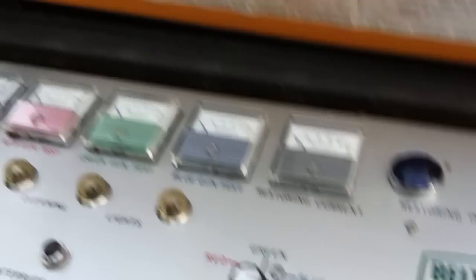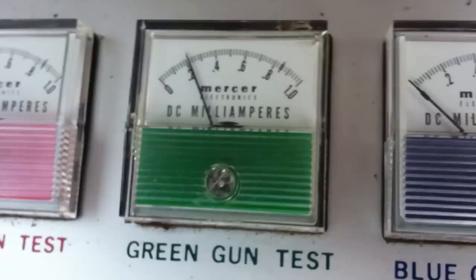We got the Beltron set up. We'll go up here to about between 5 and 6 volts — 6.3 — and no emissions yet. Be patient. There's the filament going. You'd be surprised, some of these high-hour sets had newer CRTs in them and then they were retired, although it doesn't look like that's the case with this one. It's coming up very slowly, not much emissions left on it.